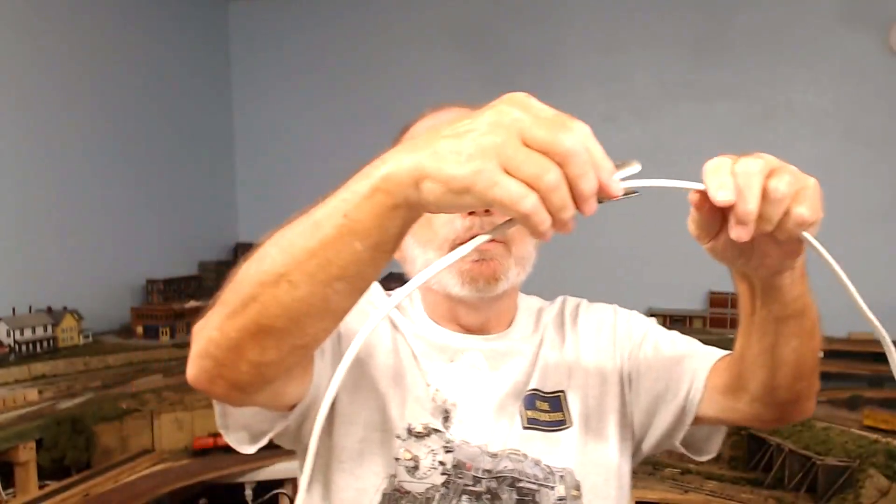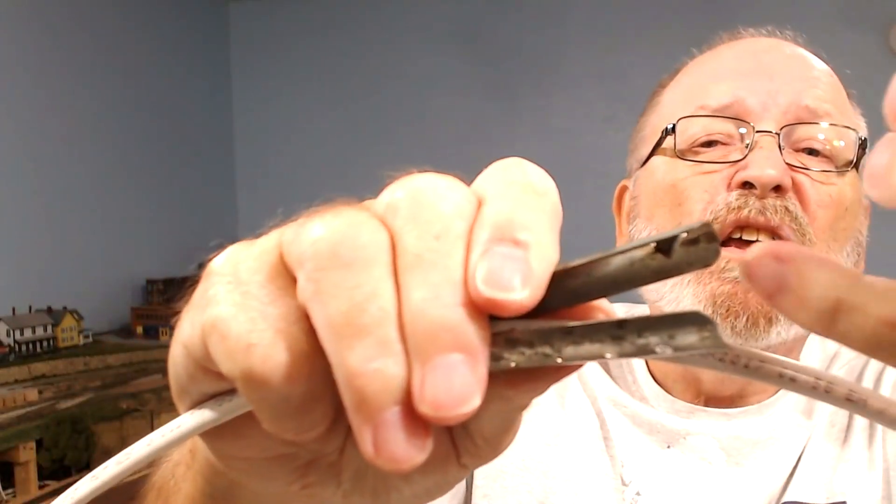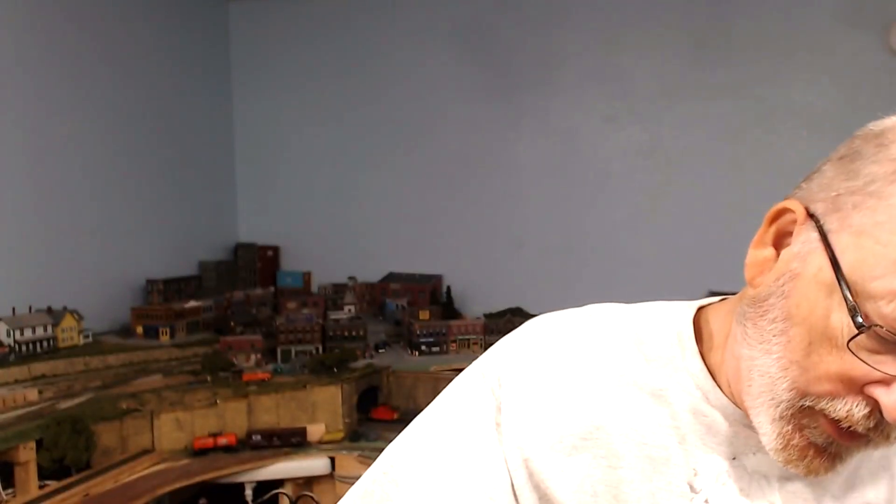I've got my stripper — it's over 30 years old. Here's the Romex: it's a black and white wire with a ground wire and a covering over top. You run this up on your wire and there's a little blade in there that sits down on it. You squeeze it down the center and pull, and what it does is strip the coating off the outside.